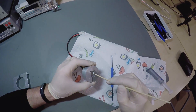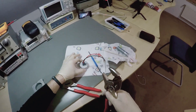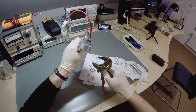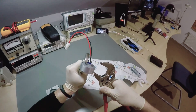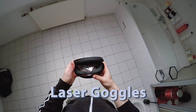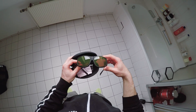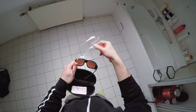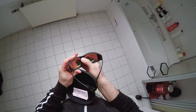I'm going to apply some thermal compound and press in the laser diode. Not sure about the heatsinking performance of this contraption — maybe it needs another finned heatsink on top — but I think I'll leave it at this for a first test. Laser class 4, the most dangerous one, begins at 500mW output power. And I'm going to be using a 2W laser, so I didn't skimp on protective eyewear. They even included these snap-in sub-goggles for maximum protection — I have no idea what they are for.